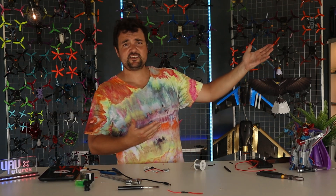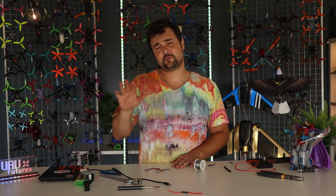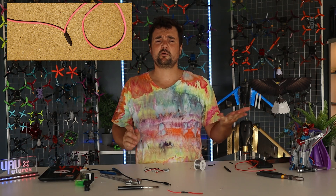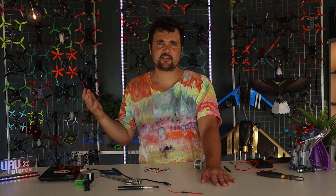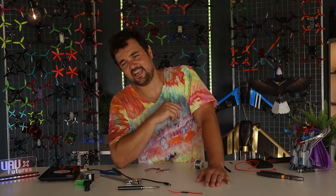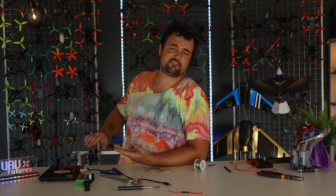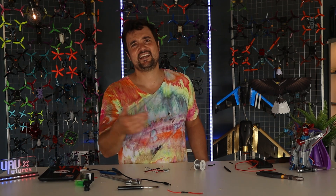Another example: my mum accidentally cut a 20-metre extension lead while hedging — probably $30-40 to replace. She was going to throw it in the bin but I cut the wires, soldered them together, covered it in heat shrink with some strain relief, and it's perfectly salvageable for backyard use. So there you go — saved mum some money and got my daughter a free scooter. Other than that, subscribe for more FPV content. We've got reviews, flight footage, and if you check the playlist there are more videos on how to fix your drone in the Repair Any Drone series. As always, happy flying!